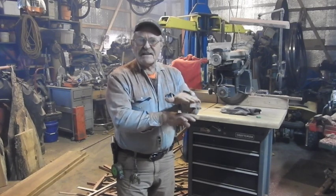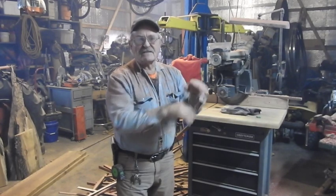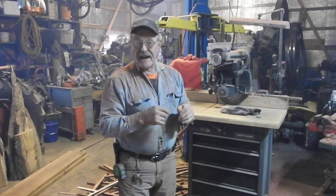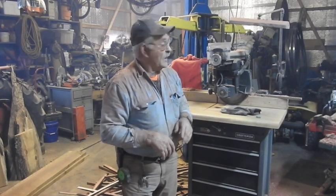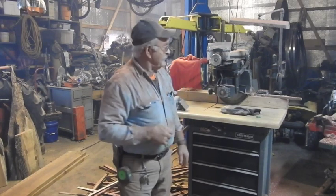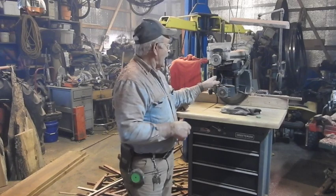Occasionally you have to set stuff off to the side in singular stacks of individual boards, and I just like 12-inch stacking strips for that particular application. Right now I had to shut it down because the Craftsman saw ran along a pretty long cord and kind of overheated. So I've got to blow a little air in there, blow the sawdust out, and get it to cool down and reset off of its overload.